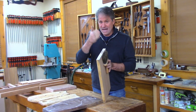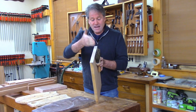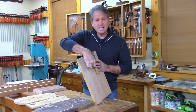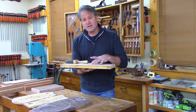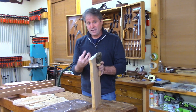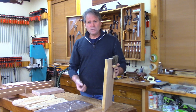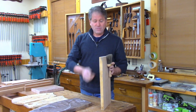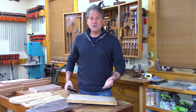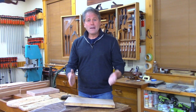So what I'm going to make is an end grain cutting board. When you're cutting, you're not cutting across the grain — you're cutting down into the fibers. It gives you a very different action with the knife. The knife can almost get stuck in there a little bit, but because of the nature of the composition, the knife slices and then it sort of heals itself. It's also much harder material than the side grain. A true butcher block table is not side grain — a true butcher block is when all of the blocks are oriented so the end grain is facing up. Those massive tables that butchers would use, they'd be hitting into the end grain of hard maple, or beech. Really tough stuff and it could last for years.